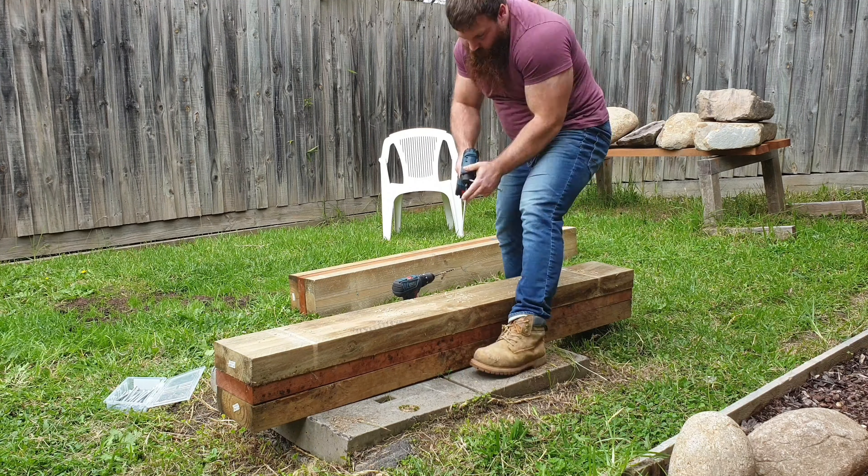I couldn't find anything that was 45mm — if I could I would have sanded it down just so the plates fit nice and snug. The board the plates sit on was 240mm wide, 450mm long, and 30mm deep. The posts weren't exactly the widths stated because hardware store timber tends to run a mil or two over. I lined them up and drilled through into the farmer's walk to attach them.